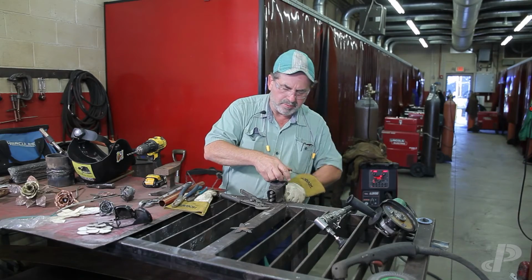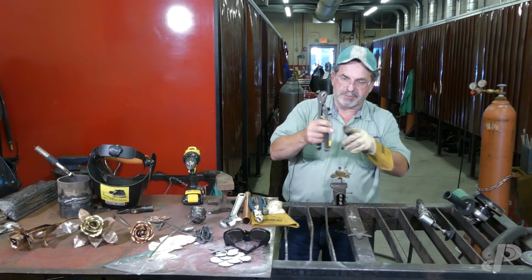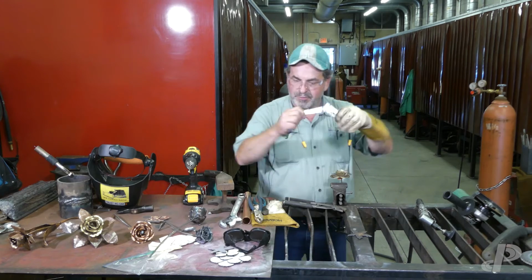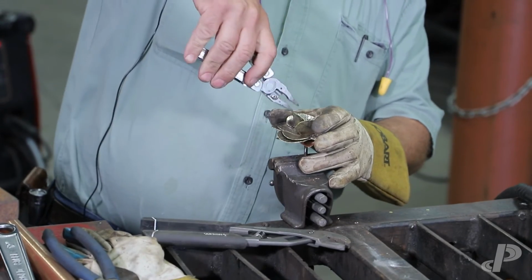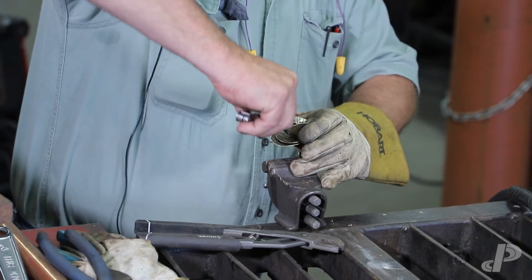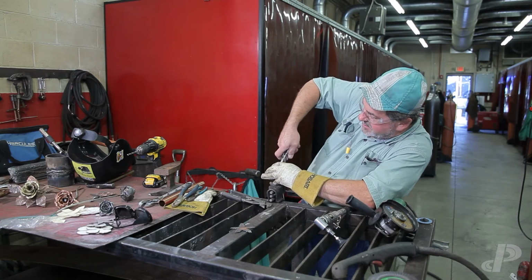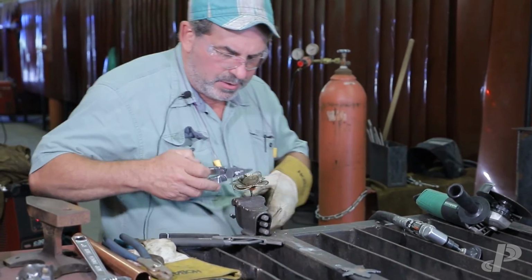Okay. Now I'm going to put it in here, and I got a pair of channel locks that I bought just specifically for shaping this stuff. And I use my Leatherman, which you will never find me without a Leatherman ever, because it's such a useful tool. Okay. Now I'm going to start bending these over. And that's what's nice about a non-ferrous metal that's a little softer versus steel, is that they're easier to shape. And that's why I chose it for this particular outing.